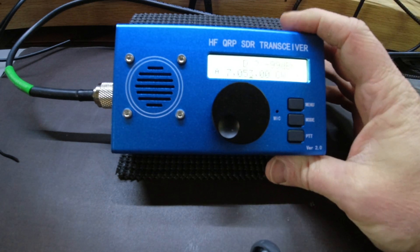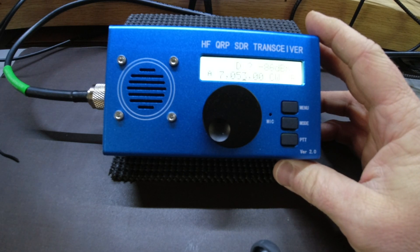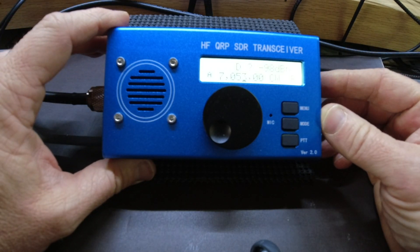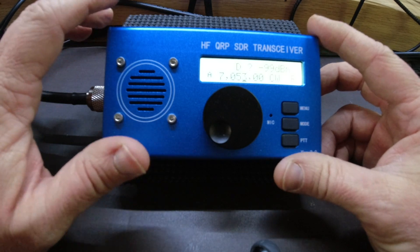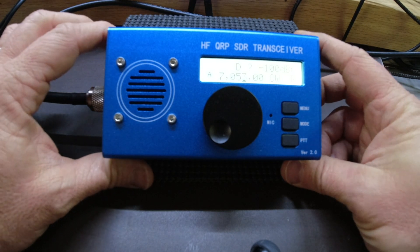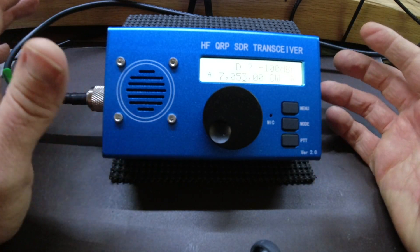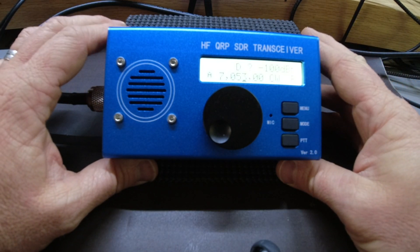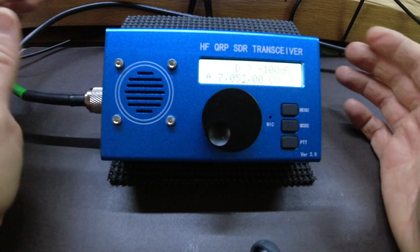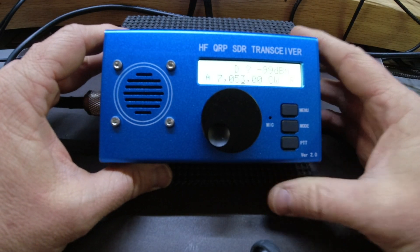But let me talk about the cons. I had planned to do a park or summit activation with this just to show what it's like, but there are two reasons I'm not doing that. I went to my buddy Vlado's place and we put this on a service monitor and looked at it on a scope. The CW signal is a little noisy on this — it also produces second and third harmonic spurs at least. We couldn't verify exactly if it was over the FCC's spectral purity benchmarks, but I'm going to assume if it isn't, it's awfully close. Frankly, it produces a fairly dirty signal, and that's a really big issue because I like being a good neighbor. I don't want to use a radio that's causing spurs and looks all nasty on a spectrum display.